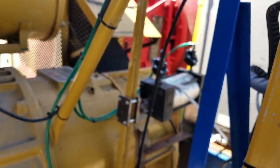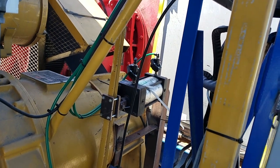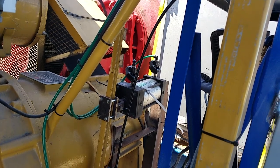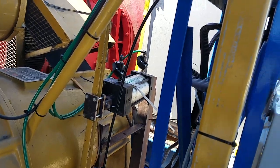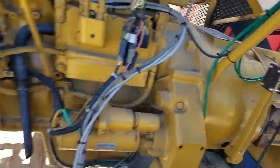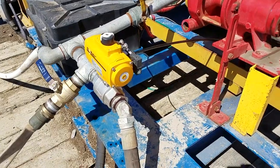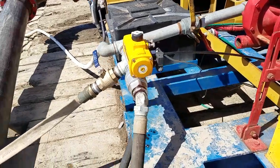Your intake and discharge pressure transmitters that we're reading are back here, and your gland pressure transmitter. And here's your clutch. The way the code does this is it gives a 5-second signal when it tells it to clutch in to one of the solenoids. For 5 seconds, it takes less than that to happen, but the air pressure is built up, and it'll push that clutch in. And when it clutches out for 5 seconds, it'll energize the other solenoid. Unlike service water, your gland pressure valve is actually just a single valve, so my code keeps that coil on the whole time the clutch is on.